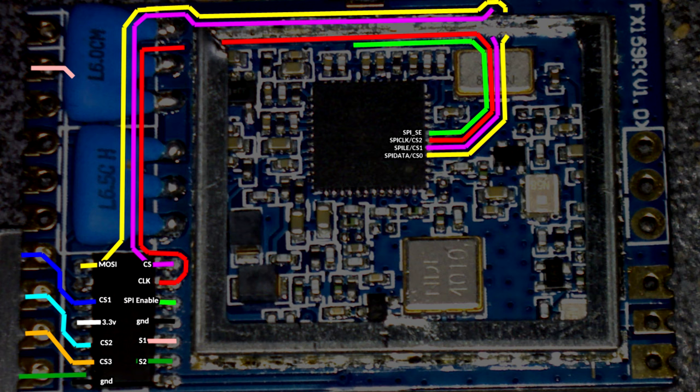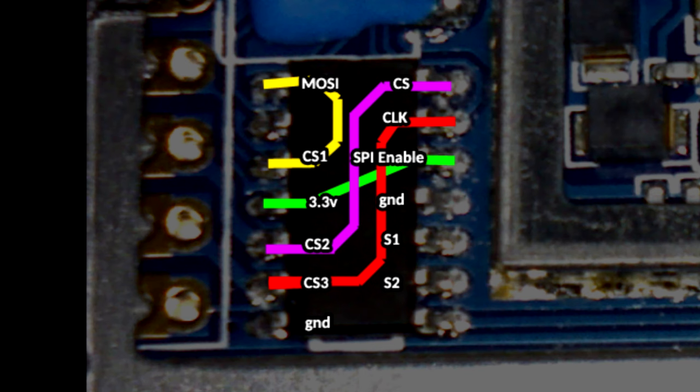their microcontroller. You can see it's a fairly simple task to just desolder this little microcontroller from the bottom corner and either direct solder little leads onto the pads that you can then use. Or what I'm planning on doing is taking this schematic here and just bridging these, reworking these pins across.